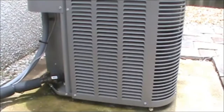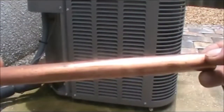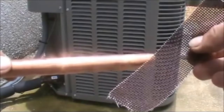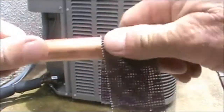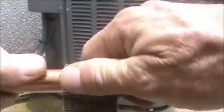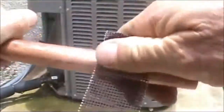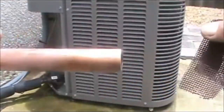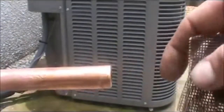One of the first tips — you don't have to do this, but this is what I do to make it a little bit easier. If you have your piece of pipe that you're getting ready to braze, I will usually clean it off with the sand cloth or mesh-type cloth. You can see there's some corrosion and discoloration here, so I'll mark where I'm going to cut the pipe and clean it at the point where I'm going to make the cut.